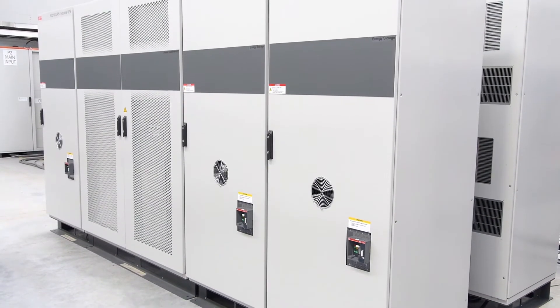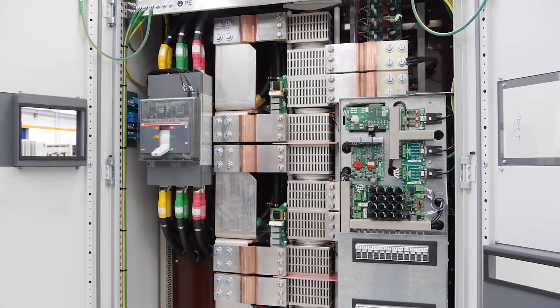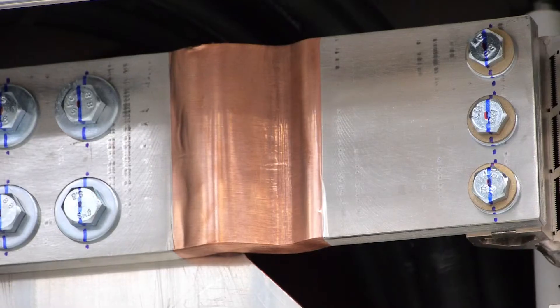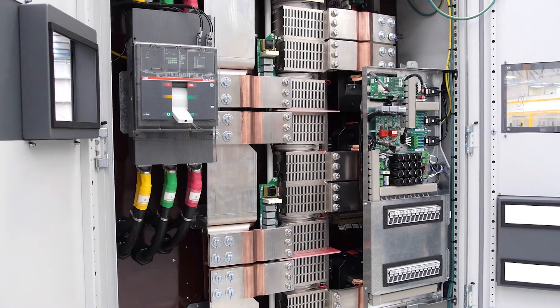It's made up of four principal components. The utility disconnect is a low-loss, ultra-robust SCR thyristor switch. This component supports the load current and can commutate off in less than two milliseconds.